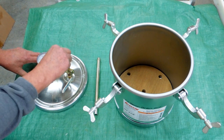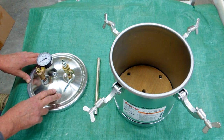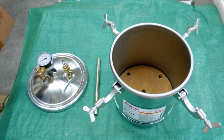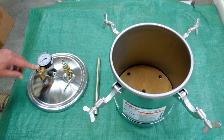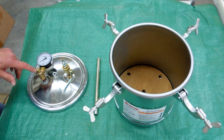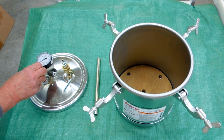There's a valve on here — you connect your air hose and look at the gauge to control how much pressure you put in the pot. This tank is 45 PSI maximum pressure; the book says 50. You can't get to 45 because the pop-off valve is a little cheap — it tries to pop off at about 42 and keeps leaking until it gets down to about 30. So I've got a new one on order; my new pop-off valve is going to be 55 PSI.